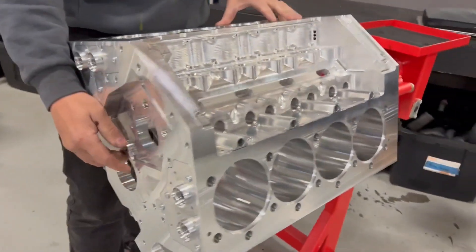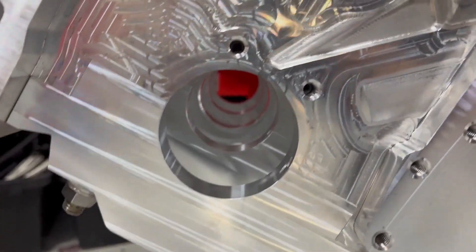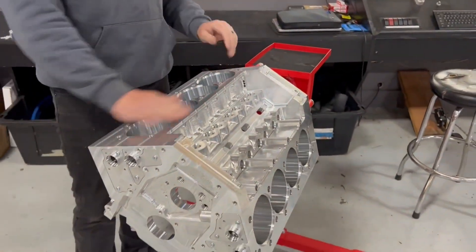We've also made this with a cylinder head package — because we have a different head bolt pattern, our cylinder heads and our block only go together. Nobody else's head is going to fit on this, and nobody else's block is going to fit on these cylinder heads. It is our block, our cylinder head package, and intake manifold. Everything else is Cleveland main for this — so if you have a Cleveland main crankshaft, that's what we're supplying it with.